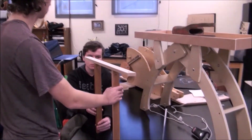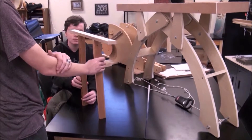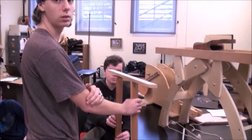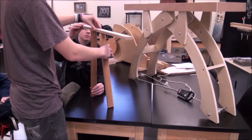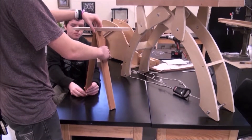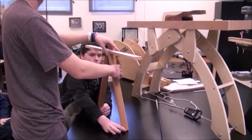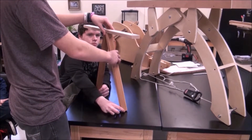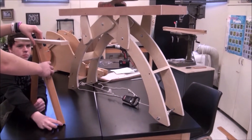What kind of bridge is this? This is a beam bridge — held up by two posts, and the posts are in compression. If you angle these posts, it's still going to be in compression because the deck is still pushing down on the two posts. And if instead of being straight lines, they're angled like this, then we have an arch bridge. It's still going to be in compression.